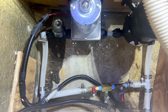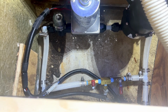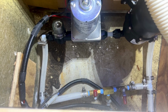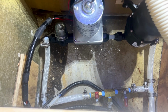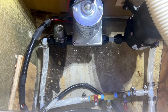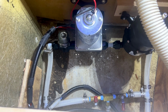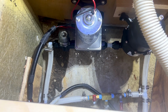It works well. It's actually turned on and pressurized right now, and it hasn't kicked on since we pressurized the system. So the kicking on that we were getting, I think just helps confirm the backflow that was happening through the pump. It was bleeding off pressure. I tested it at the various faucets, and the extra little bit of gallons per minute and the little bit higher pressure seemed to make a big difference in the bathroom and in the kitchen sink. So kind of excited about that, to have a little bit better water pressure and just more flow.